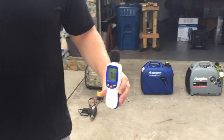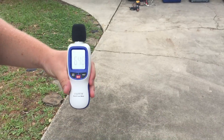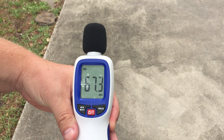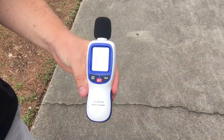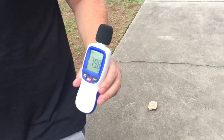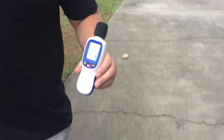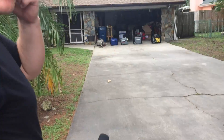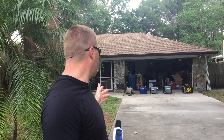Let's go to 20 feet under a load: 67 to 68 decibels. Go to 30 feet: 63 to 66 decibels — a little bit of variation there. And now we'll go to 50 feet: 60 decibels. So under a full 1500-watt load on the Honda EU, 60 decibels at 50 feet.